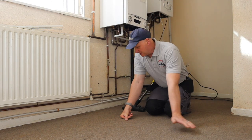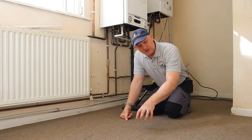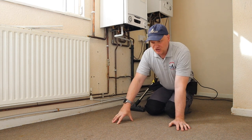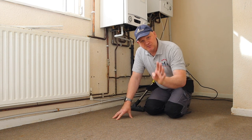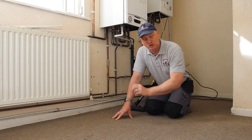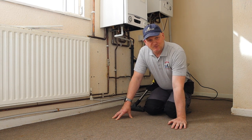Depending on the floor you're actually laying this laminate floor on will depend on your preparation. One of the things it says is you can't lay on carpet or on carpet underlay - you have special different types of underlay for this laminate floor depending on what you're laying it on. So let's have a look at the different types of underlay first.